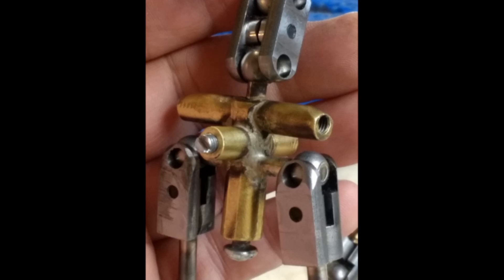On top is a ball that handles the back joint. This waist assembly has rig points with 10-32 threads to receive 10-32 rig screws, so that when the puppet's on set, it can be rigged and held from different directions — from the waist left and right, from the waist front and rear, and from the waist center vertical from the bottom. So it gives more options to the animators on how to hold it.